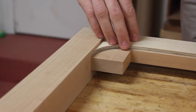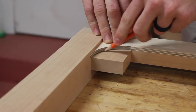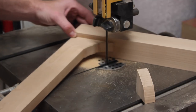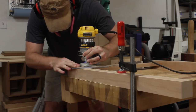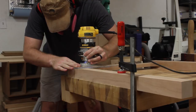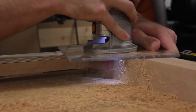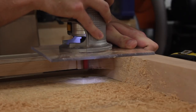I made sure to keep these vertical stretchers square so that I could have a nice clamping surface to make sure that the joint was closed completely. With two of the side assemblies glued up, I could begin routing the curved feature of the stretcher. I'm using a little template that I made with a compass, and I could take it to the bandsaw to get rough cut, then move on to the router with a flush trim bit. I had to add a larger sub base to the router so that it could keep its balance on the awkward positioning of this cut.